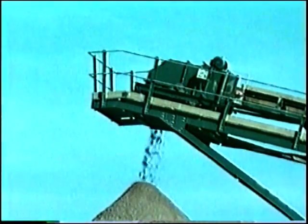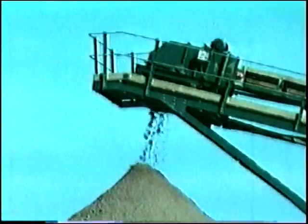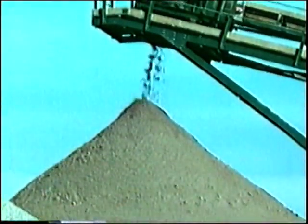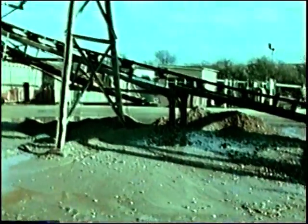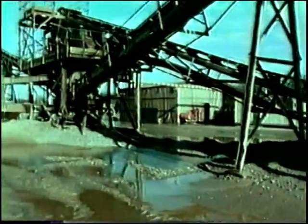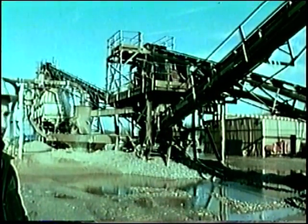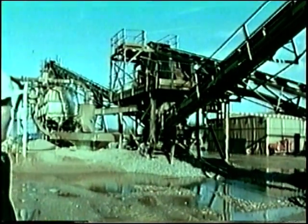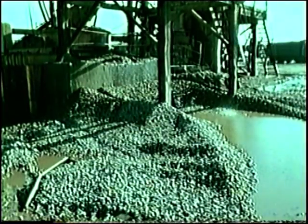Working environments of conveyor systems are such that access for maintenance has always presented a problem. Spillage is one of the problems brought about by the carryback of material on the belt. The carryback of material contaminates the roller bearings, which then fail and can cause belt damage. Just one T-type scraper fitted to the head drum can save many man-hours of cleaning up.